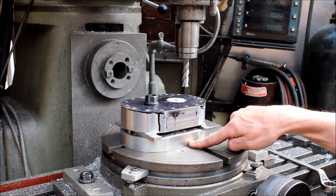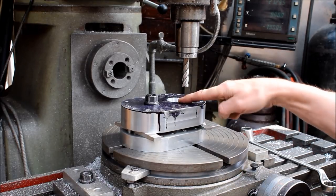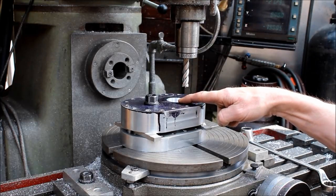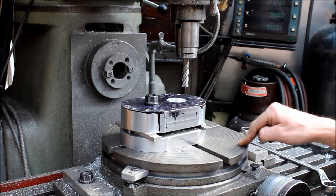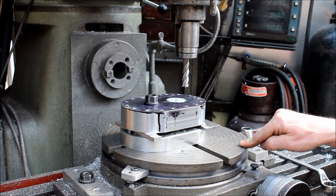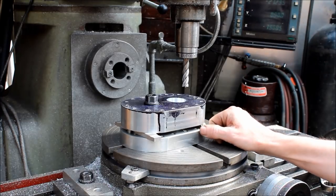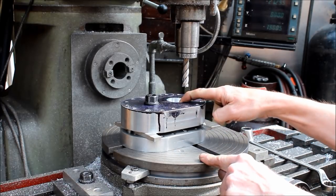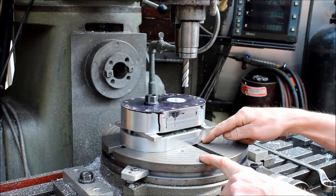The template is underneath - it's been bored and it's dowelled. What we're doing is opening up where the seals go and the bearings for the inner case where the gears are. We've done the outer ones. Yeah, you were asleep while I did that. So we're doing them individually and popping them on a mandrel on the rotary table.